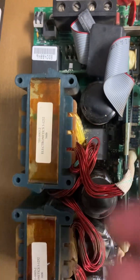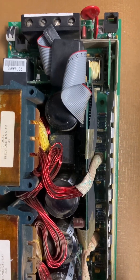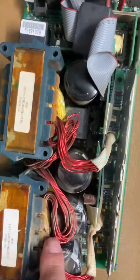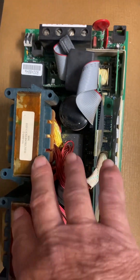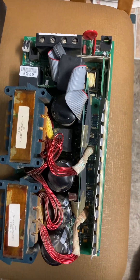Sometimes it's not even worth repairing something like this. The board is like $400 brand new. The MOSFETs vary on price — if you want the originals, they're like $9 a piece, or you can get them for like maybe $2 a piece. There are 13 of them. It might not even be worth the repair, but I'll definitely just try to repair all the MOSFETs, replace all the MOSFETs and the capacitors and the relay just to make sure everything's there.